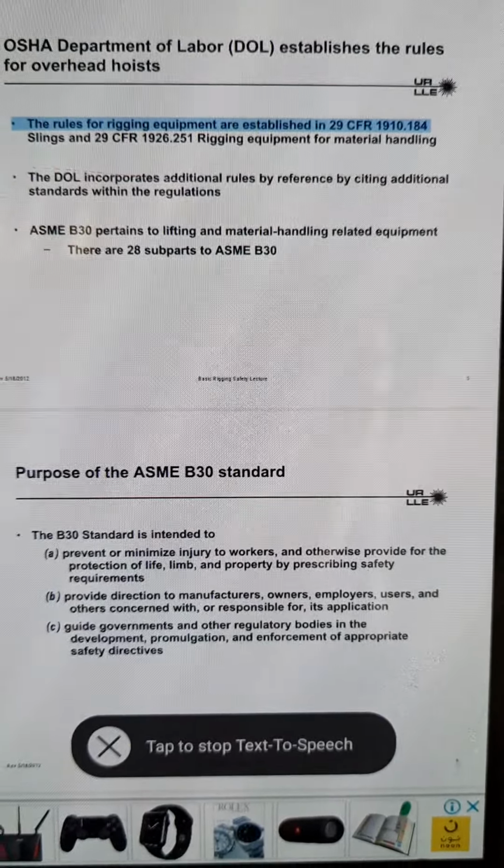Rev. May 18, 2012. Basic Rigging Safety Lecture 9. Select rated rigging equipment based upon the payload and how it is used. Know the load capacity of the overhead hoists and support structures. This includes hoists, bridges, jibs, or gantries. Know the load capacity of rigging hardware used in the rigging operation. This includes the shackles, hoist rings, straps, etc. Know how use of the equipment affects the load rating. Use only load rated products. Never exceed the rated load capacity of any piece of rigging equipment.